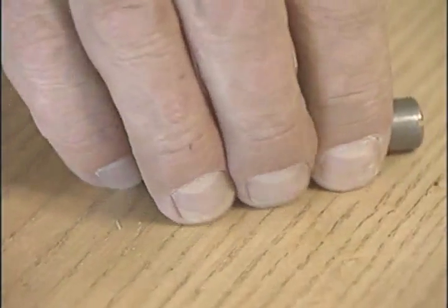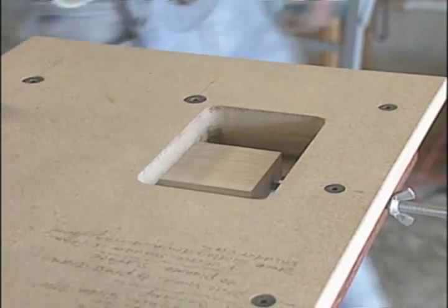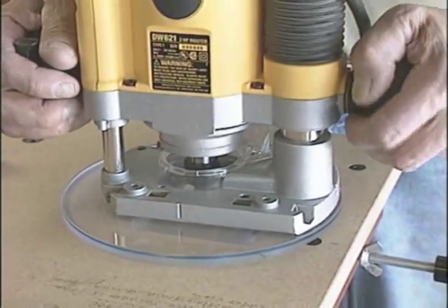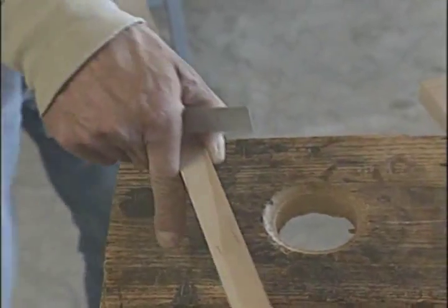The cutter of choice is a short-fluted, shank-bearing trimmer. The bearing will roll on the window's edge when I make my final pass to establish the shoulder. This edge must be straight and free of defects. It will telegraph any blip right into the work.